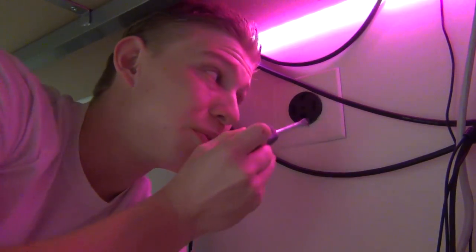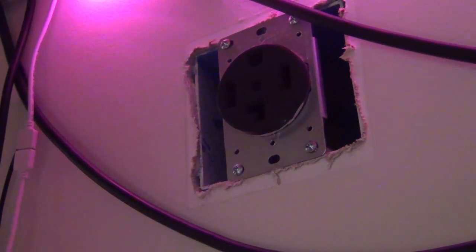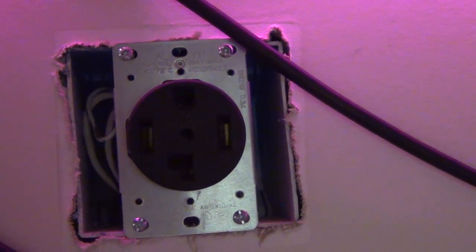We're back under my desk with the good old dryer outlet. I'm going to unpanel this and we're going to check out if there's enough space in there to put in two outlets, or if I have to put it in a box hanging off the wall. This is great news - this is more than big enough to fit two outlets natively. That box back there has two screws that this dryer outlet is installed in, and each can handle one outlet.